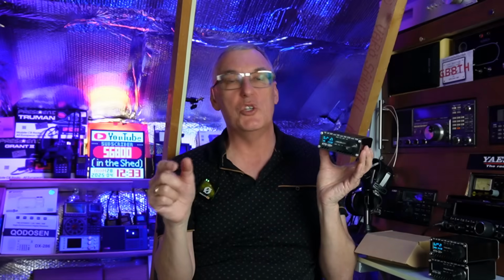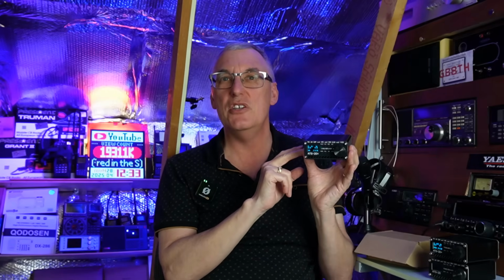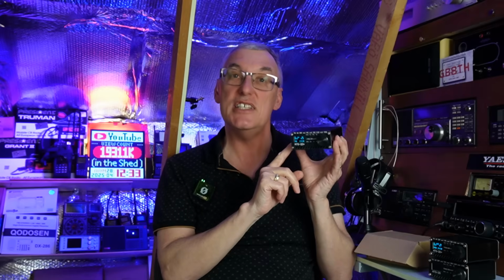I mean, there's nothing else I can say other than perhaps a USB dongle when you've got to run it on a laptop or a PC. There's nothing else that you're going to get for £20 that's going to give you sideband, upper and lower sideband. Covers a broad spectrum of HF frequencies on shortwave. I can't remember exactly. I think it goes down to something like 2 megahertz all the way up to 30 megahertz. Covers the 11 meter CB band.